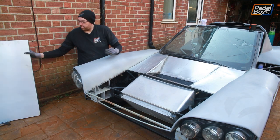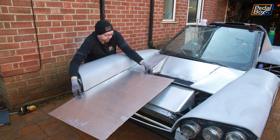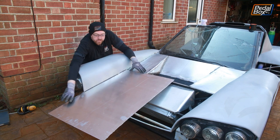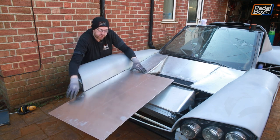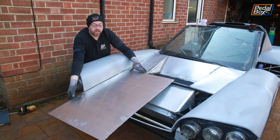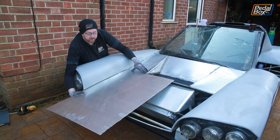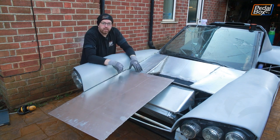So we have to improvise something else. Using this sheet of aluminium — if we go dead straight down that way — this becomes very much a ridge line where it kind of scoops up slightly and then drops straight off, and it looks wrong. The solution is to lift the centre of this a little bit. There are two ways: one is to curve the front nose, which really doesn't look too bad but still presents the problem of how to support that edge with a curve. The other is to just lift the front a little bit — we worked out it needs to be about an inch higher — which allows for a little curvature in the side without being so much that it's difficult to get a nice even bend in some angle iron or box section.